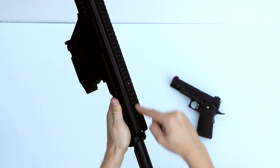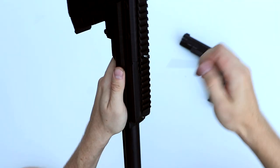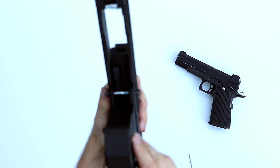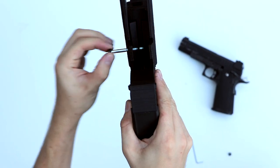Now back to the carbine kit. We're going to take off the back portion — the cover — with these two screws that you can take off with a hex key. Then you gently wiggle it back and forth to take off the top cover. Next, we're going to remove the slide bolt from the carbine kit because we need that to assemble the gun. So take off the nut and take out the bolt.